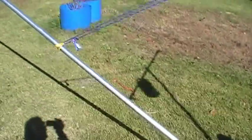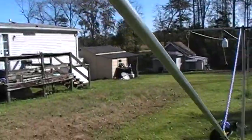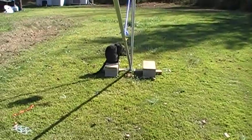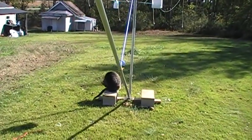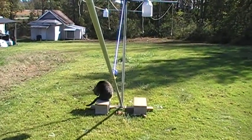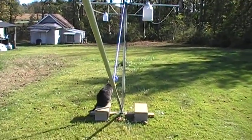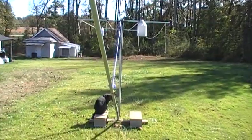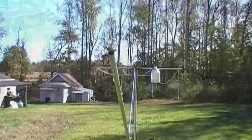All right, on a serious note, if you do decide to build up a test fixture for your antenna, I'm going to bring something to your attention. Be sure to use at least 50 foot of coax cable when you go to tune the antenna. If you raise this thing up and then try to stand underneath it with a 10 or 12 foot section of coax, you'll think it's tuning, but by the time you get the wire hooked to it and you got the length hooked to it, you're going to realize very quickly that your center frequency where you tuned it will shift. And by the time you get past 40 or 50 feet of coax, what you'll realize is that as long as your antenna is tuned here correctly and whatever you raise it up on, as long as you're not near a structure that's going to have an adverse effect on it, the tuning will stay pretty true on it. So I wanted to bring that to everybody's attention.